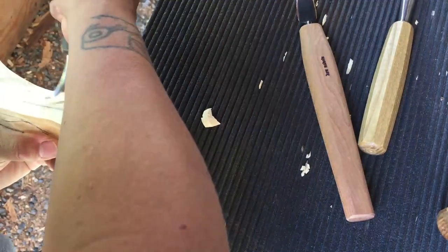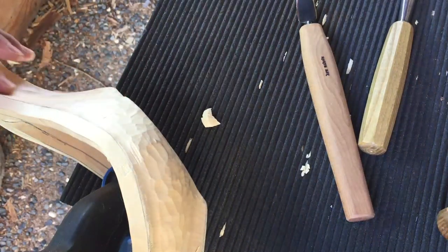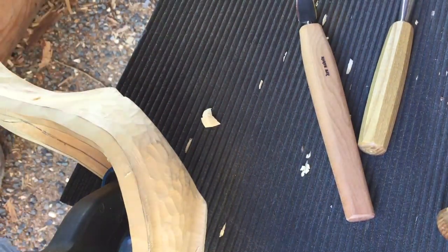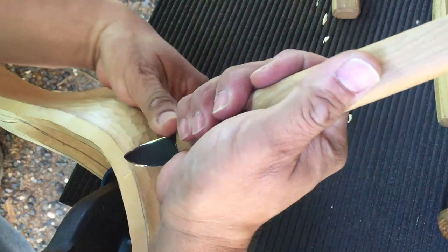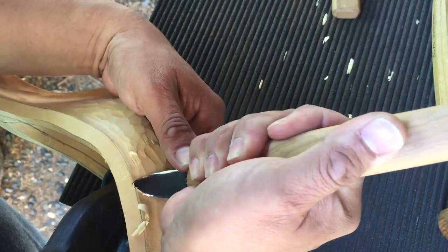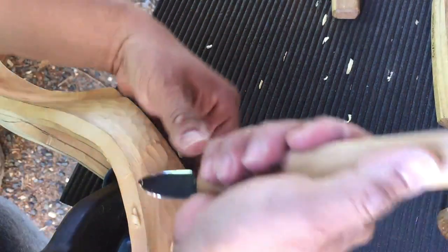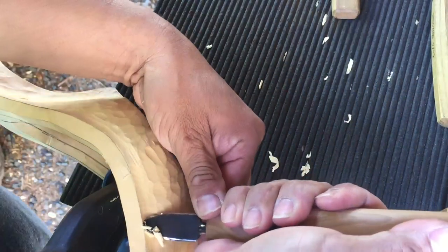Things start slowing down at this point as you're getting a little bit more of the finishing in there and just getting this front portion of the bow done, and getting this a little bit more smooth. I was using the bent knife on the front here just to smooth out the gunnel line. You can see there where I've drawn back in pencil, and I'm just using this curve here. I don't really want to have a really sharp edge or corner to that gunnel right on the inside of this cut here. I want it to be a nice round edge, nice and smooth and round.